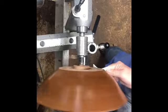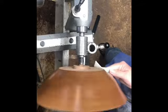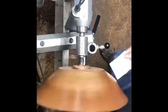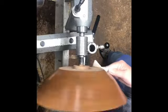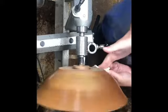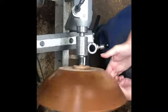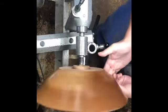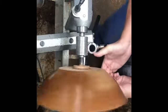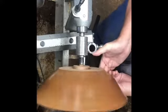The boiled linseed oil has dryers in it. They don't literally boil the linseed oil, but they add dryers into it, which when you add alcohol to that, when you thin it with the alcohol, it causes it to dry even faster. And then when you are burnishing that in, I'm applying a bit of pressure as I rub back and forth, heating all of that up. And what that does is causes that chemical reaction in both the boiled linseed oil and the shellac. It causes it to dry even faster. So this is a fairly quick, it doesn't cure that quickly, but it does dry that quickly.